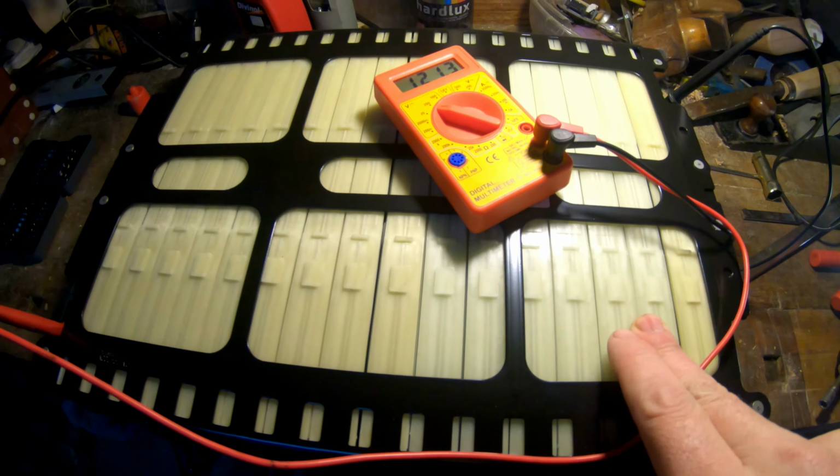I will build another battery bank, but it will not be 48 volts. I will see how it will go. But I will do it the same way as here, or I will make some changes, I will see. But these blocks will stay here, and I will make some box here in summer when the temperature will rise, so I can cool it. For now, when I charge it, they don't heat up because the charging amperage is low, 2 or 3 amps, but it works.